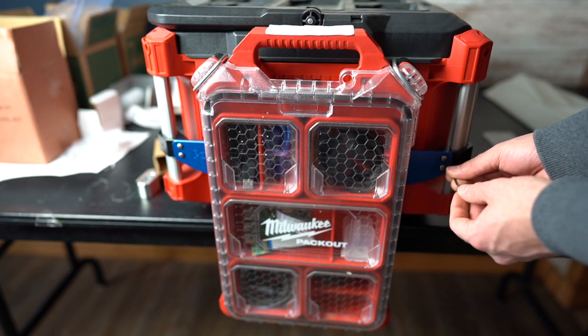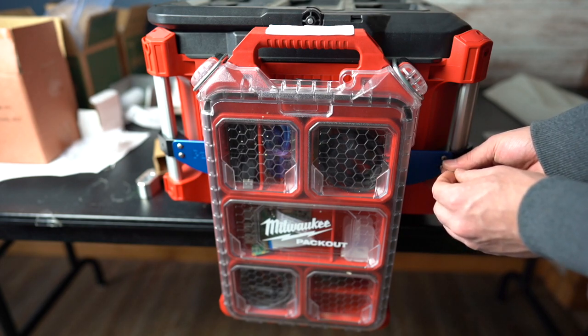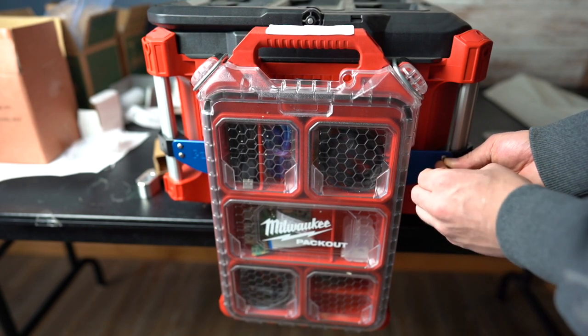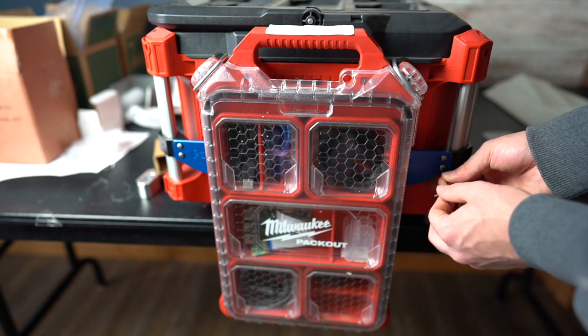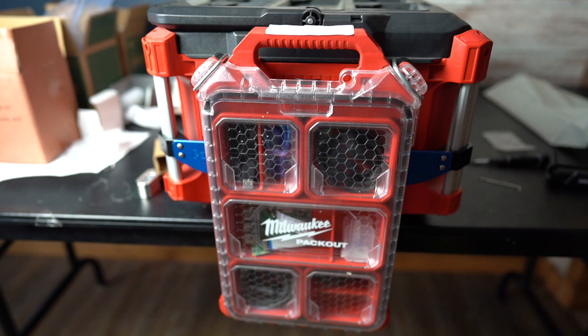All right, now, I don't want to forget to mention, make sure that you go in and tighten down the 4 screws that hold the plate to the mounts once you got everything else secured and adjusted where you want it. And again, no need to over torque these, just go in, get them snug, and maybe an extra quarter turn. Beyond snug is more than sufficient torque.